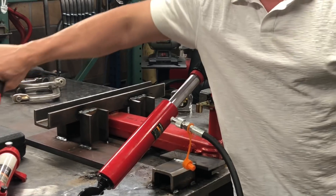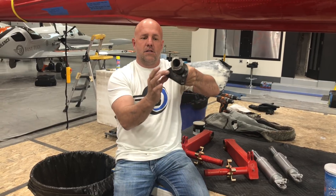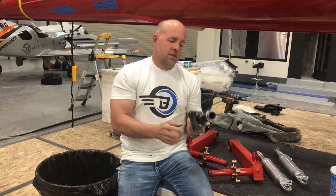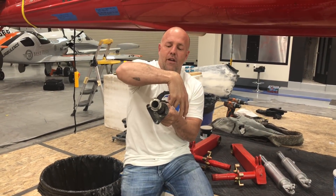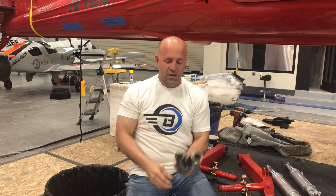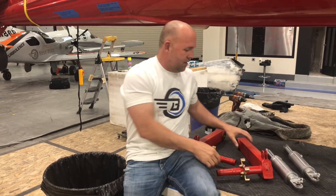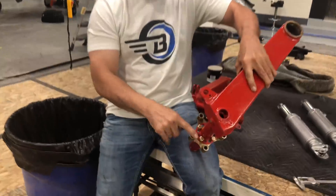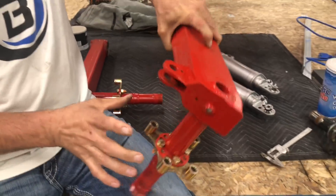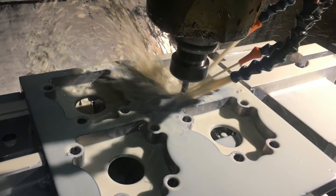So one thing: I had to make a stronger axle, which I did. But this part holds the brake caliper and I wanted two sets instead of one. You can't just take these and stack another one on the other side because they would offset an eighth of an inch - they actually have to stagger to work. You can't just buy another part. So like always you dive into a project and it gets bigger - I made my own parts so the alignment is correct, one caliper on this side and one on the other.